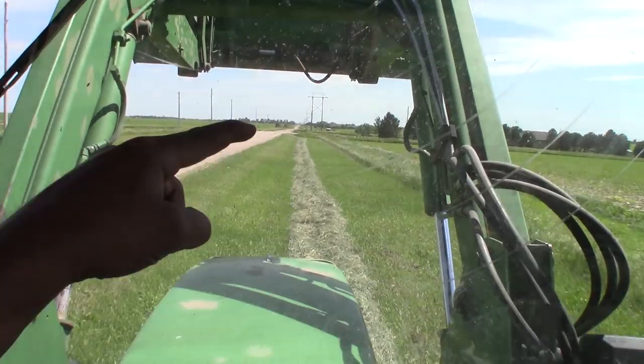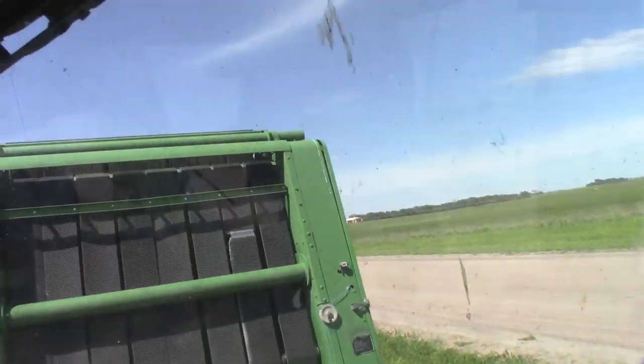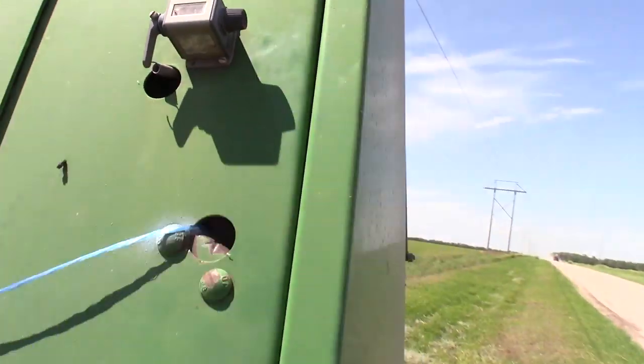All we gotta do is go to right there. So we're almost there. We're just about pushing a 3 foot bale, so this is gonna end up being 11 and a half bales. It's gonna be at least a week before we bale, so I'll probably just go ahead and wrap it and just have a small bale, because I don't wanna leave it in the baler that long. Call that good.